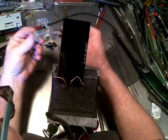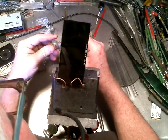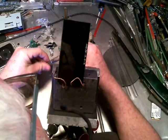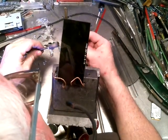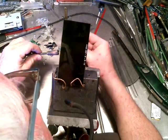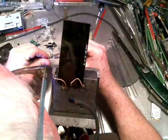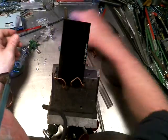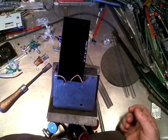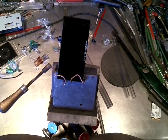Here's a simple one — that one doesn't snug in so well, so I've got to redo the joint end. Now that I know what I'm doing I can probably do it fairly simply right where it's at — just heat up that tip, do a cold weld right there, get it just the right temp, and snug it in a little bit better. That's all it'll take and you've got one nice joint. The rest of them are nice and snug into this female fitting. Thanks for watching, and as always enjoy your day.